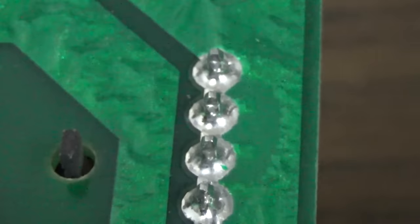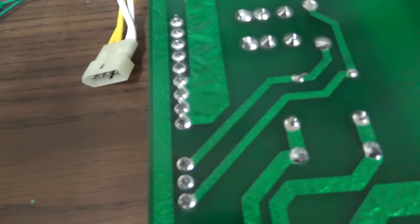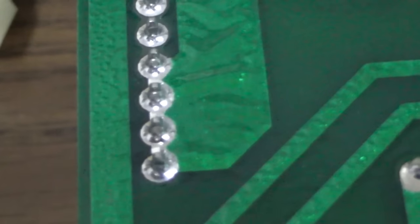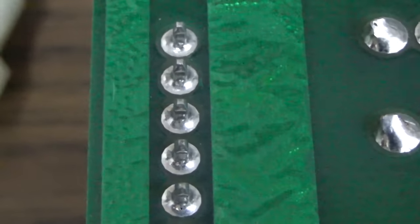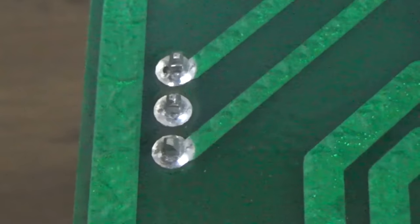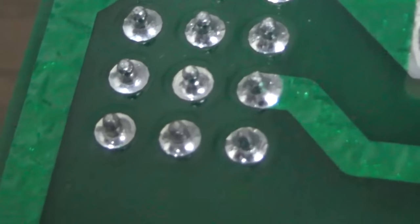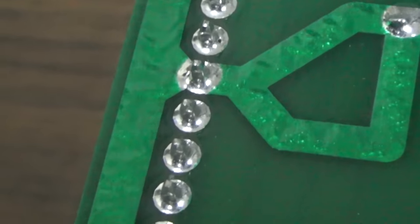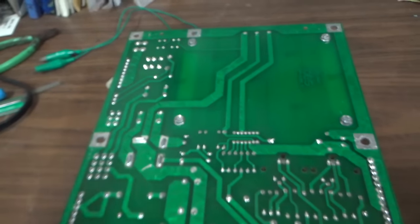I don't know, those solder joints look pretty decent. There, at least. I don't know which connector does the 5. But I think we might be looking at it right now. I think this is actually the general illumination, I believe. I mean, they're borderline. I don't know. Sometimes you can't tell till you heat it up. So I will reflow the solder on all those, and we'll see if any of them fall apart while I do that.